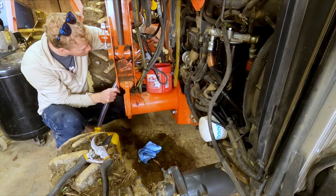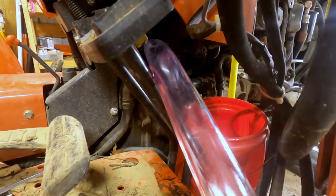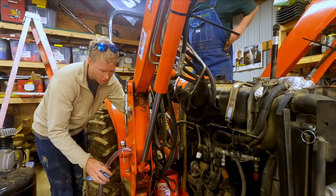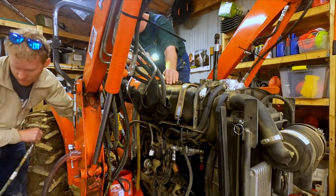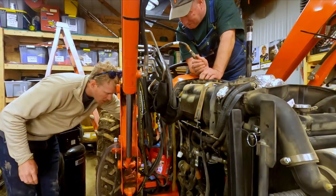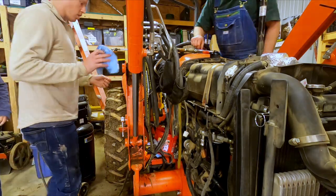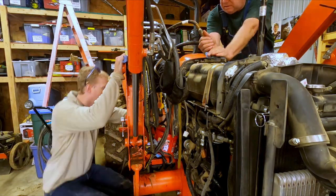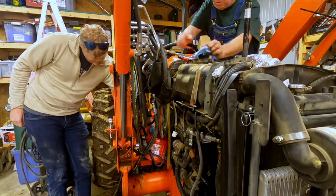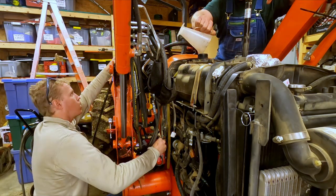Now that the fuel is flowing freely, what we don't want to do is just put the gas cap back on and re-prime the system, because that junk is still in the fuel tank — we're going to need to wash the tank out. We removed the bonnet for this; it is absolutely not required. Drain the tank by taking a larger vinyl tube and putting it over the fuel line and draining into a five-gallon diesel can. Once it's full, clamp the line and grab another can until the tank is empty. Once empty, add diesel back in in small increments and blow air through the top of the tank to flush out any particles, contaminants, or dirt that was clogging the line.